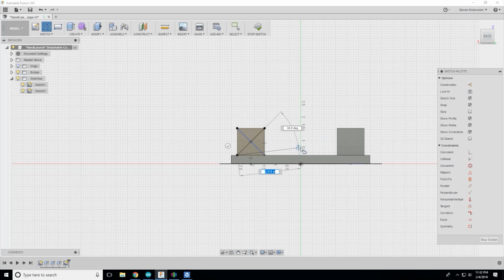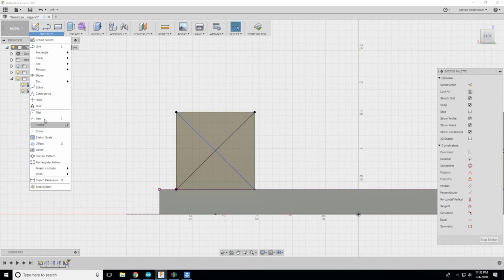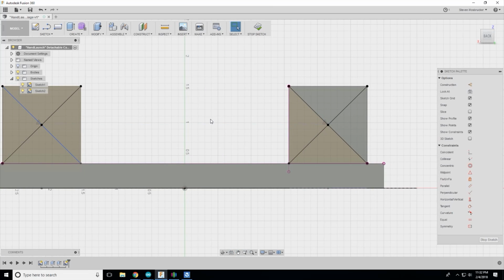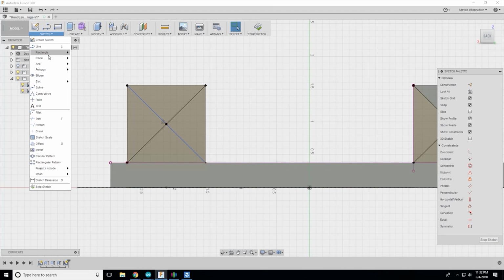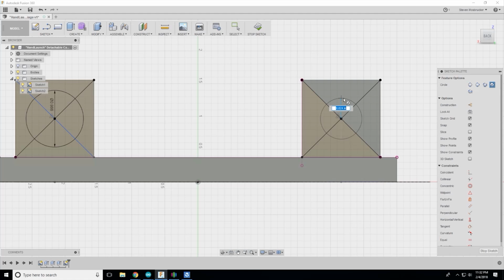As you see, these bearings are going to be massive. Because we want still a pretty low center of gravity, this is not going to be beneficial here. So we might need to change our bearing choice. That's okay. We'll take a look at it right now. Okay, so we're going to do a circle, center point. This is 0.2 millimeters for right now. Obviously we would need to do adjustments so those guys press fit.